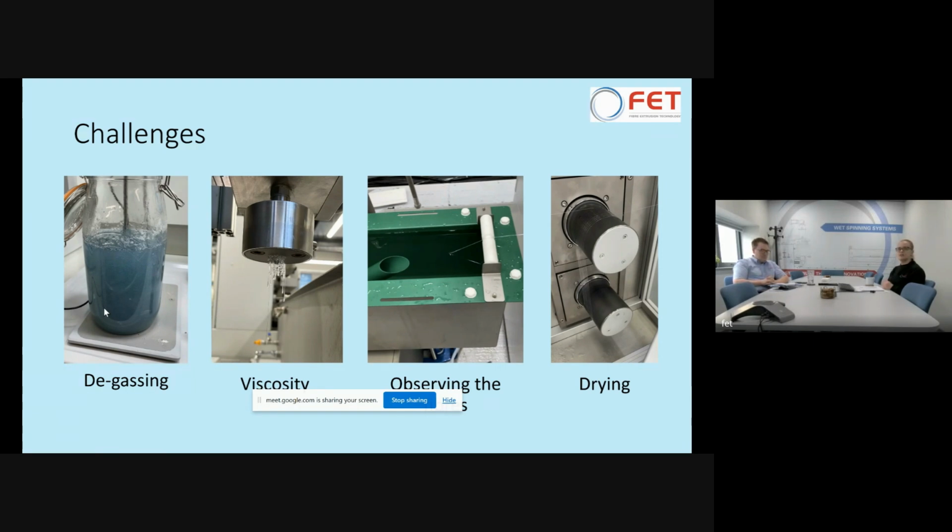Next, you need to consider the viscosity of the spin dope. So highly viscous solutions, as you can see, the holes in the spinneret are very small. That is 100 holes in that spinneret. These are about 0.1 millimeter in diameter. Getting a very viscous solution could be, so not with alginates, but with cellulosic fibers, it can be up to 500,000 centipoise, which is similar to peanut butter, things like that. Don't want to go through such small holes. So you have to apply pressure inside the vessel in order to push the spin dope out through the spinneret.